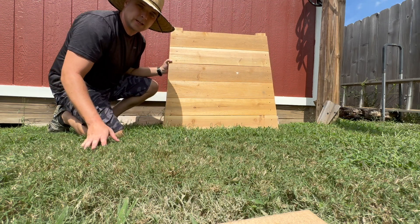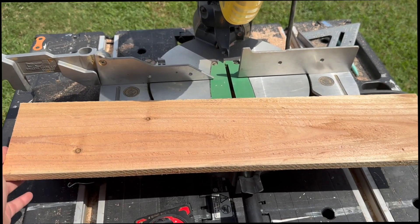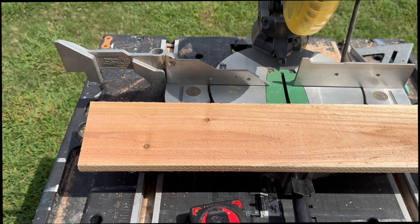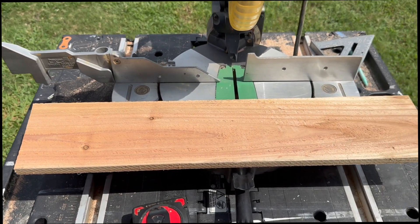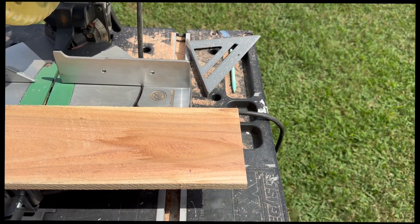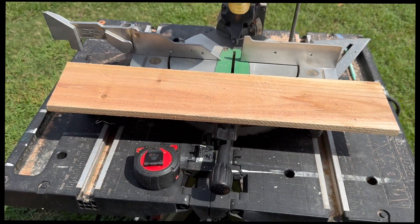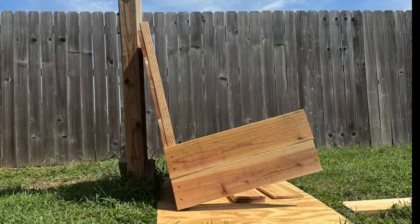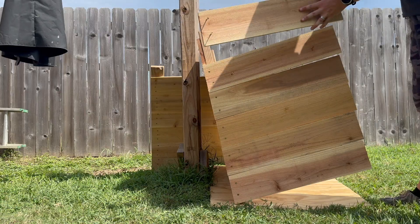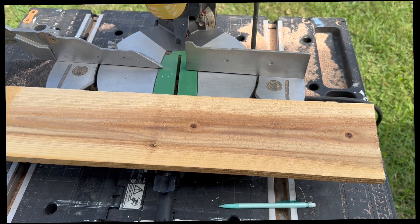Let's attach these sides. Just cut my first piece to attach those two sides. We've got a five degree edge on this end and that's going to match our angle to give us that pitch. Cut this side square to trim it at the end. I'm going to use this as my template, just to keep us honest on our angle on the rest of this box.